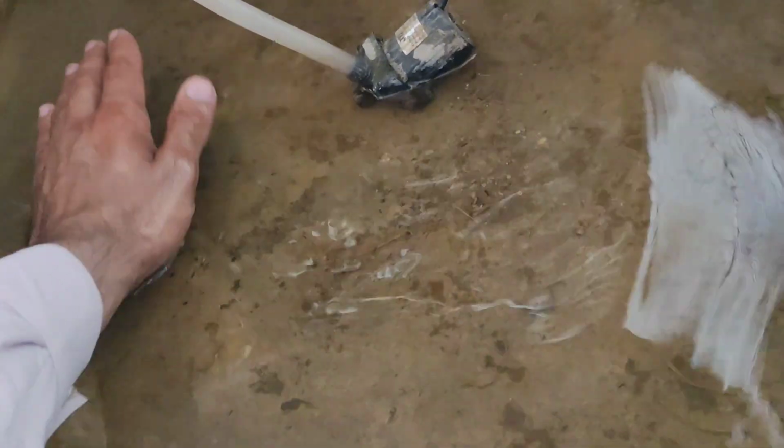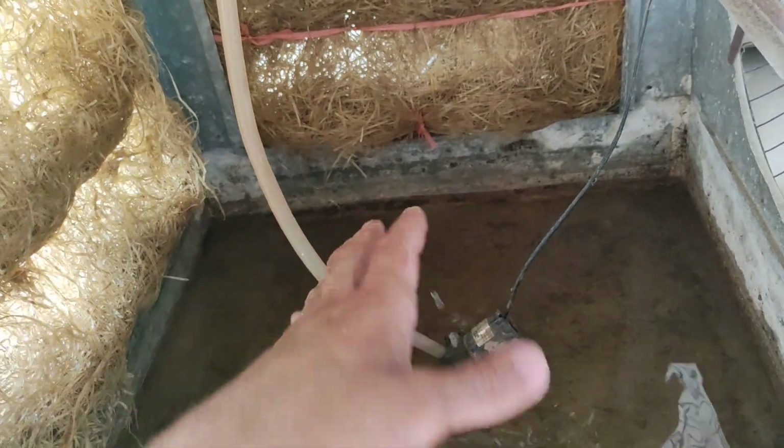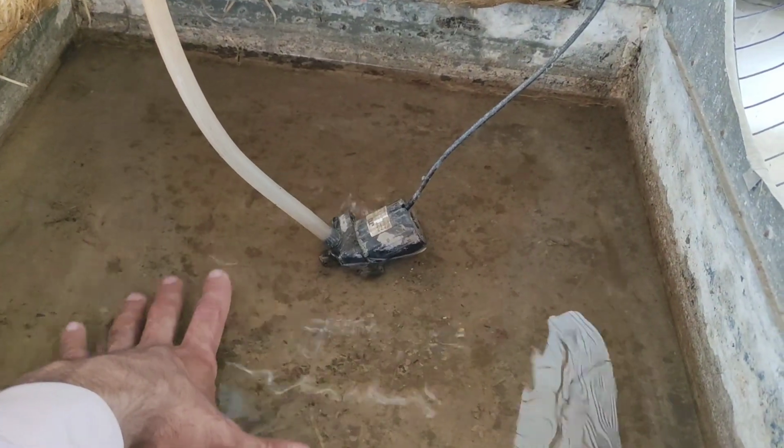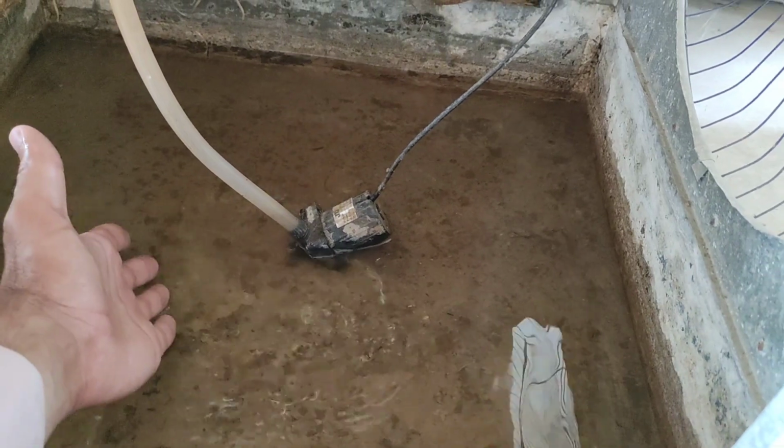It's like it's been refrigerated, but it's not. The evaporation of water from these meshes cools down the remaining water inside. Every 1 ml of evaporation of water from a liter of water lowers the temperature of the remaining water by about 1 degree Celsius.